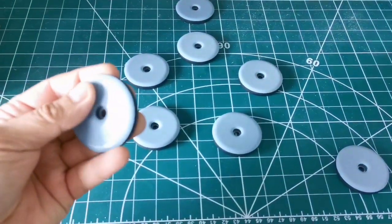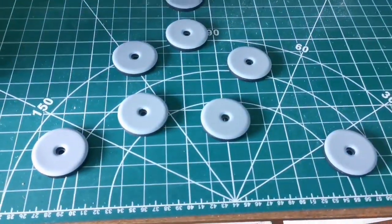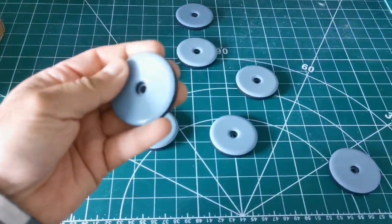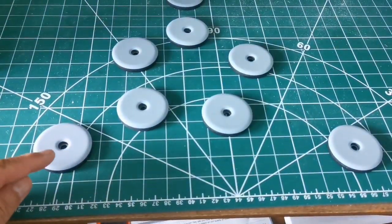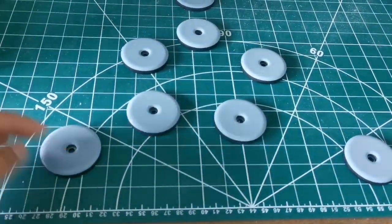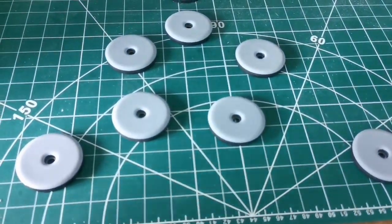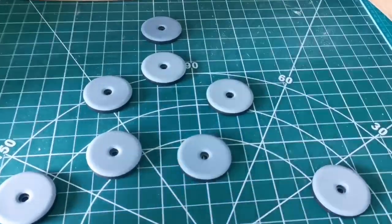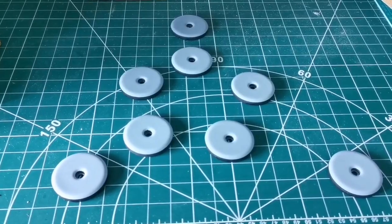That gives a good surface with slight friction, but at the same time very smooth to move. This is the property of Teflon. It doesn't start to move easily, but when it starts, it moves without much problem with a little force. And the thing is that under weight, which normally causes friction, the friction is not increased under force. It becomes kind of fluid on the microscopic scale and lets the movement happen without any problem. The friction is practically reduced under force. That's what Teflon does. So this is the unboxing.